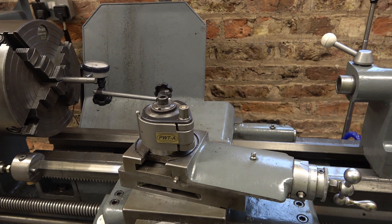So I'll put in the standard bar, I'll mount up the clock, we'll spin the chuck over and see if there's any variation. You'll see what I mean when I try.